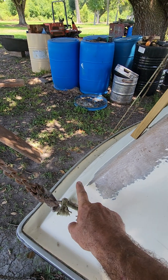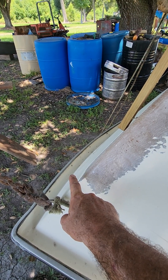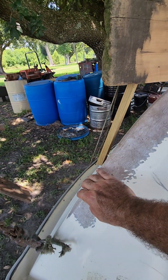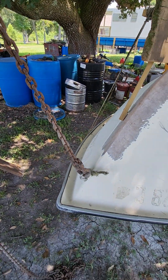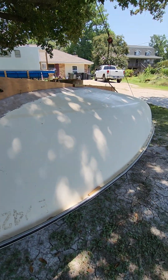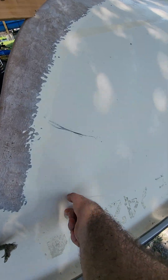For right now, I'm going to make the keel come to about right here — leave it about an inch — and let it meet up somewhere up here so I can cut my new curve. Once that's all glassed in, when the hull is finally flipped over and I can remove the eye, I can finish glassing the rest of the way all the way to the front.